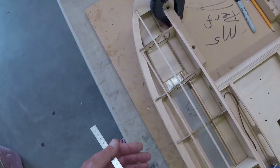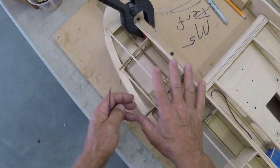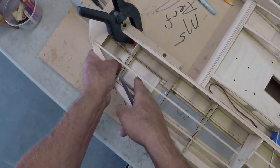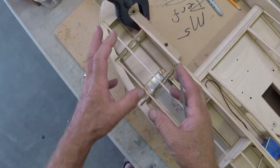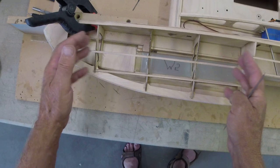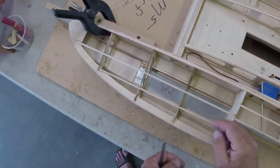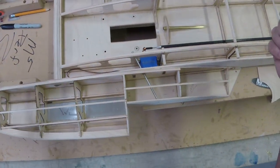It'll strengthen the sponson. We'll pour it in here, and it expands like crazy. And it's hard, and it sticks like crazy, so it will help glue our sponson together, and it'll give us impact resistance in our sponson. We need to seal it first. So you're gonna watch the video about sealing, and you're gonna seal the interior. When that sets, you're gonna put in your pour foam, and then you're gonna put your skins on.